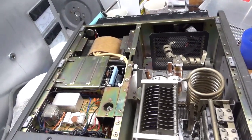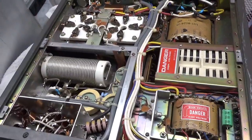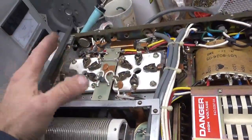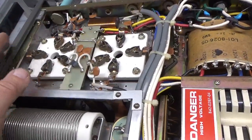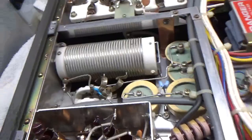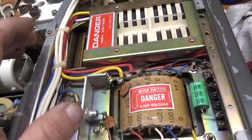I don't like turning around with the tubes in, so I always take them out. I'm going to flip it over and show you the bottom. Grounded the grids the proper way — did not use craft wire going to the screws with only some connected directly to ground. They're all connected to ground with pure copper strap. Added the strap for the low inductance mod. Band switch is clean. Got the new cap in here. Zener is good.